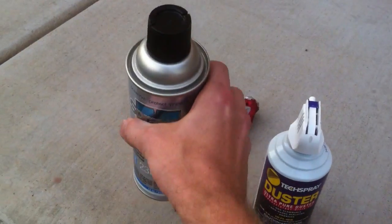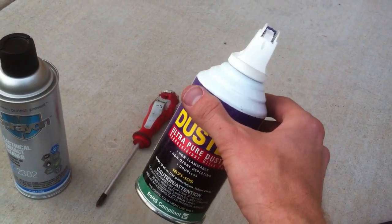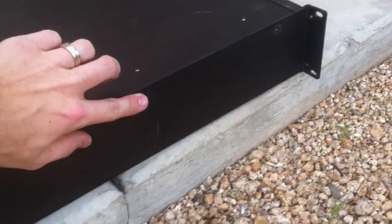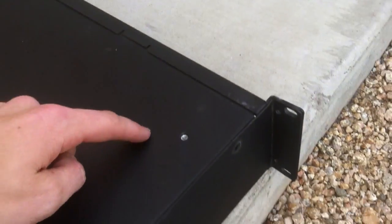So I'm going to show you guys how to clean off the circuit board with that, and then we're going to be using this to clean off the heat sinks and the fans. Grab your handy-dandy screwdriver — on this particular amplifier the top is able to be removed. We go ahead and remove all the screws on the outside: there's two in the back, three more on the side of the rail, and six going across the top, plus one big honking screw right there.